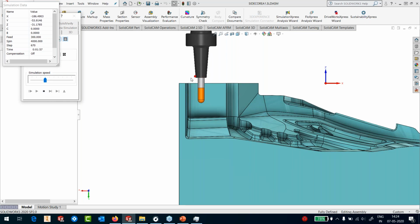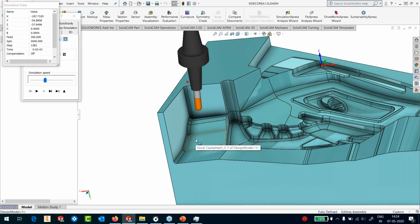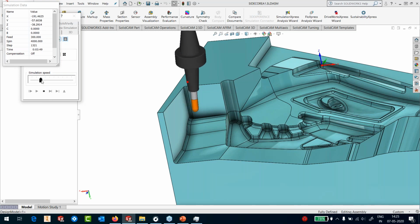once it comes close, once the holder comes close within that striking distance, it will tilt itself. You can see now SolidCAM has tilted the tool. And now it's going to perform the rest roughing in 5-axis. Okay, now it's going to perform this rest roughing in 5-axis, by clearing the tool away from, or the holder away from the part surface. It's going to maintain the clearances that I've asked it to maintain, 2 mm for holder, 0.5 mm for the arbor. So it's going to maintain that and machine every deep area in my part using 5-axis.